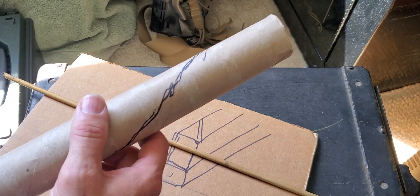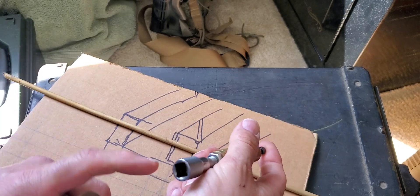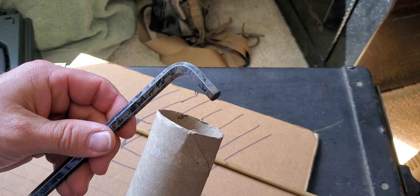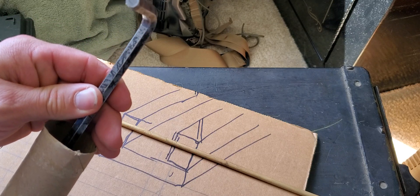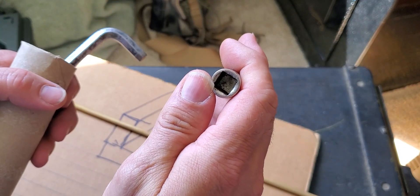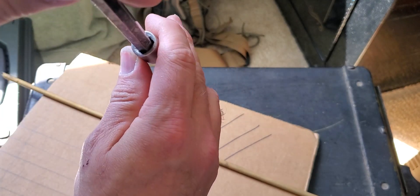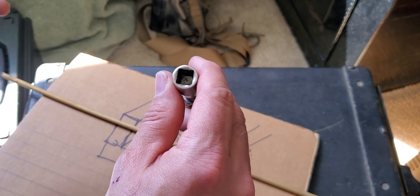And what we would do is, into the end of this wooden cylinder, we would inset - if we wanted six lands and grooves, we would just take a hex key, cut it off, and set it into here in the center. And on this end, rather than have this extension with a four-sided hole, I would have a hex cap screw with a six-sided socket. That way, every time I wanted to index this, I would just take this out of the screw, turn the screw back in, and I get six lands and grooves.